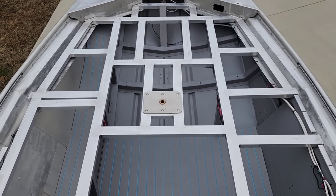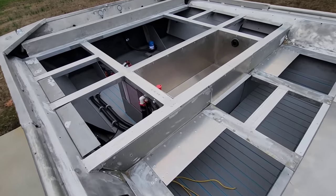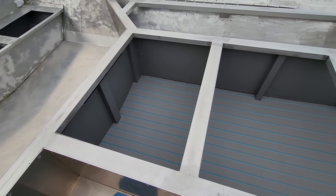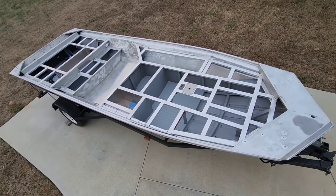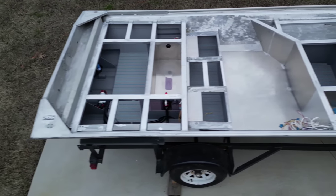All new subfloor, custom welded 1/16 aluminum tube framework featuring a tournament grade Livewell setup, a custom cooler, rod locker, and additional storage hatches. We did paint work, turf work, and all new lighting, accessories, and pre-wiring. The old Bandit is really starting to take shape at this point, with the hardest part out of the way, and we are over the hump on the build.